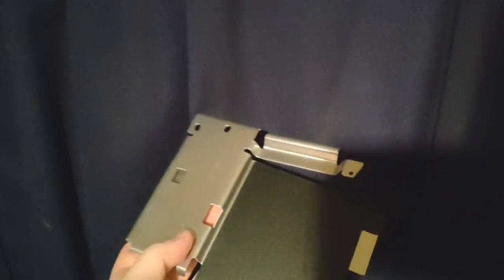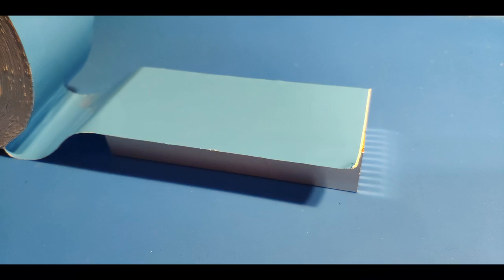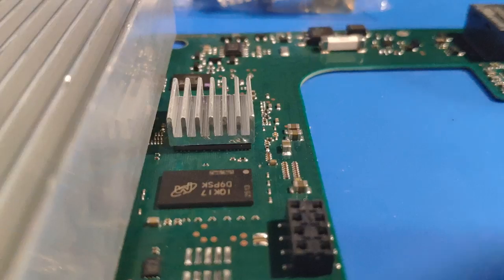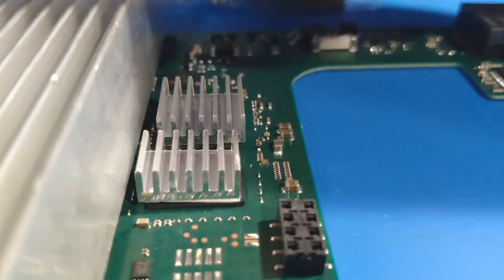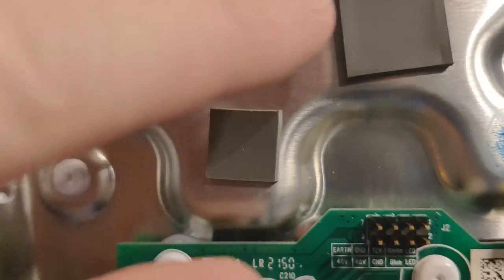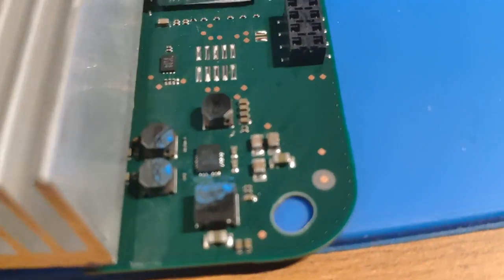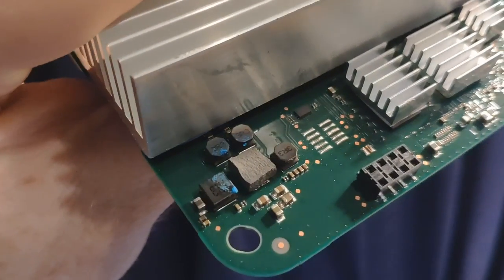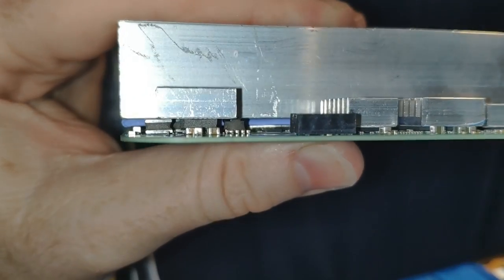With that board removed from the case, we're going to replace this ridiculous heat sink. I got a 100 by 40 millimeter heat sink off Amazon — I'll have links in the description for all purchases. That's double-sided adhesive heat transfer tape; basically just stick that on, then stick the heat sink onto the chips you want cool. I also used a Raspberry Pi heat sink assortment for all the other chips on the board. The blue material under the large heat sink was later replaced with the double-sided tape.